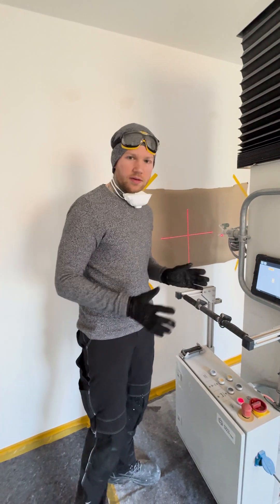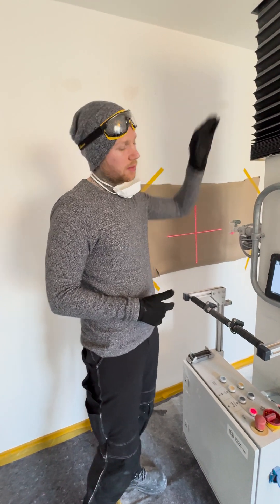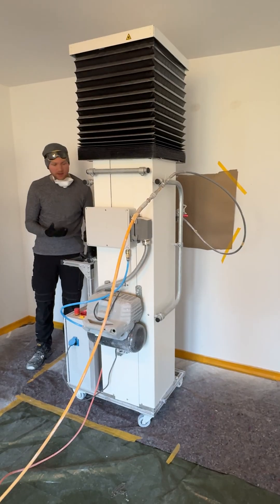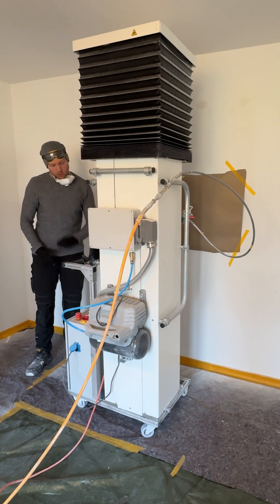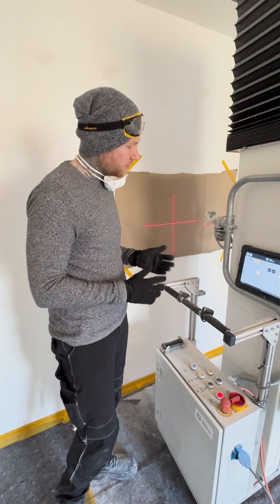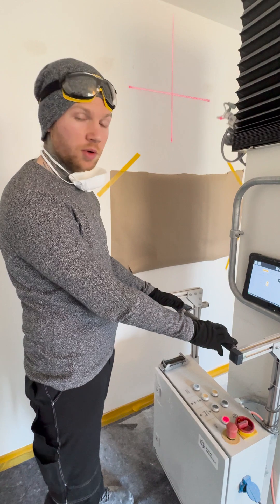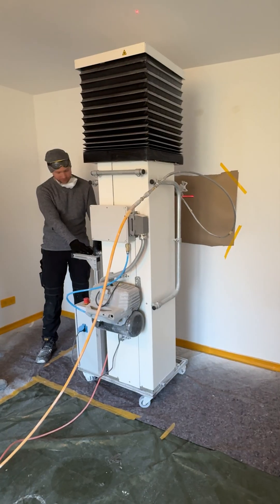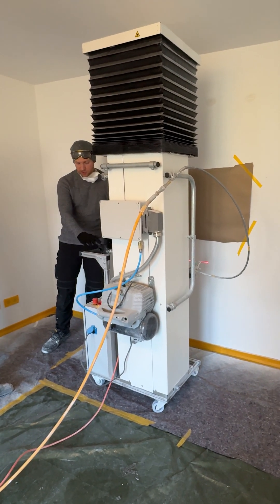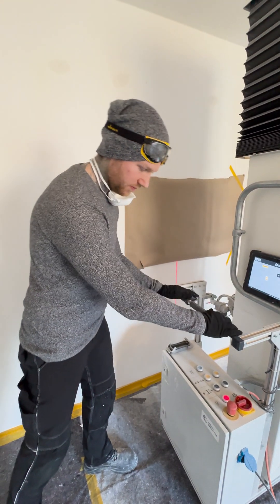In general the workflow is really easy. All you have to do is look at the bot and think: am I in the upper half or am I in the lower half? Because when I press these two buttons we're going to start the sequence. The bot will move to either the top or the bottom depending on which it is closer to, and then it will start spraying there. So for example right now we are in the upper half, so if I press these two buttons it will move up and start spraying down. When I release it, it stops spraying. Now that we are in the lower half, if I push these buttons again it's going to move down all the way and then start spraying until I release them again.